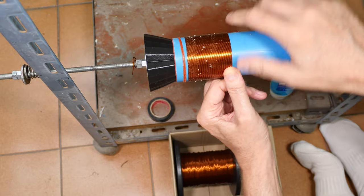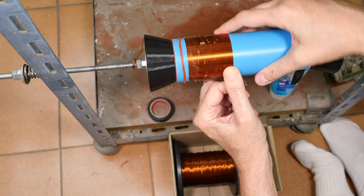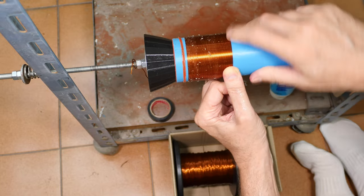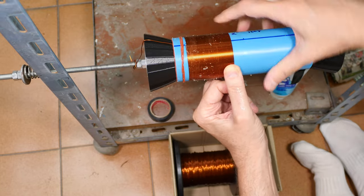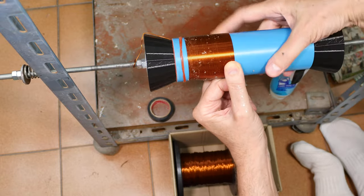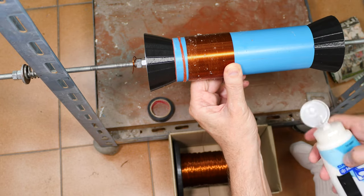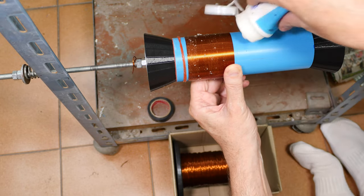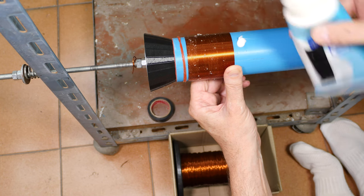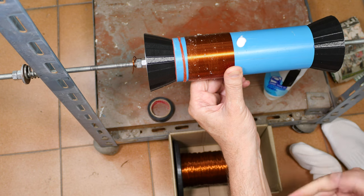So in order to make it straight and lay down, and of course a thinner wire requires a whole lot less pressure. So this is 19 gauge. And if you went with like a 22 gauge, it would make quite a difference. It'll also change the number of turns. I got a video on how to calculate the number of turns given certain parameters, and that'll make life easier. But yeah, I kind of like to use this 19 gauge.